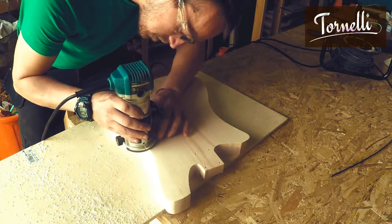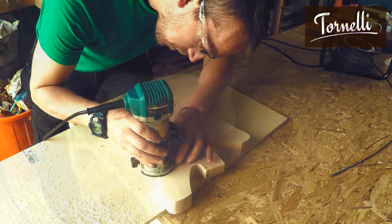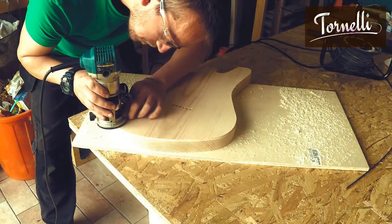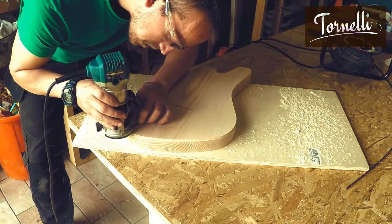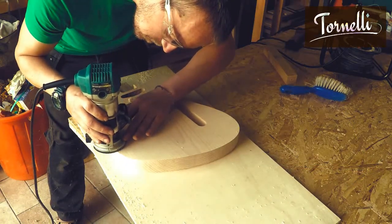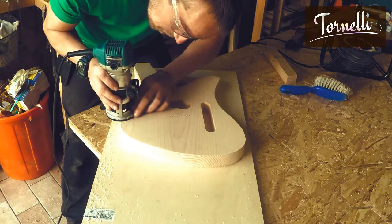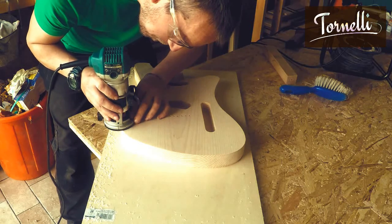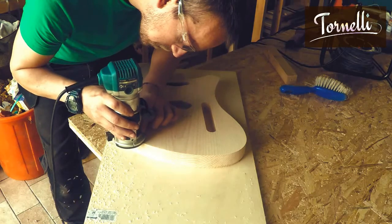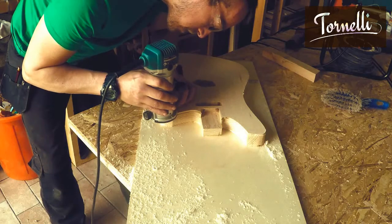What I always like to do when I'm installing binding is to have the top of the binding just slightly proud of the top of the guitar - just by about the thickness of a piece of paper - and exactly the same on the sides. I just prefer scraping the binding down to the level of the wood rather than the other way round. Setting the height on the router handles the depth to the top, and wrapping a piece of tape around the bearing bit on the router is the easy way to get the depth into the sides correct.